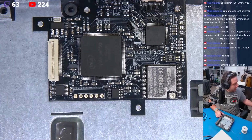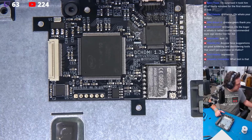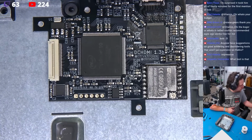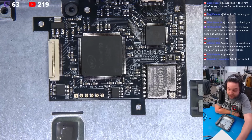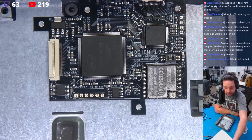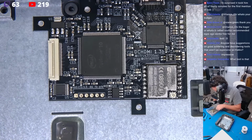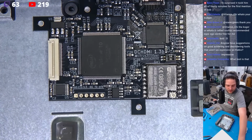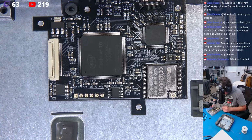So, how do we do that? Well, I'm going to see what the directions say. Drill 2 small holes using the PCB as a guide and mount the PCB with the supplied M2 screws and nuts. Drill 1 hole and mount the screw, then drill the other hole and mount the screw. It's very hard to read some of this sometimes. But, having said that, I'm going to find a suitable drill bit. Now this is an M2. Let's see, this is an M2. I'm going to use...